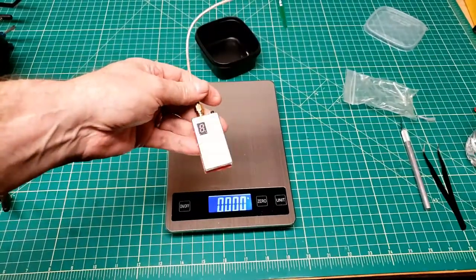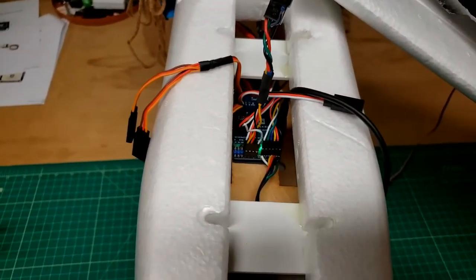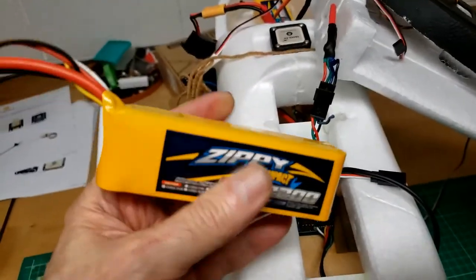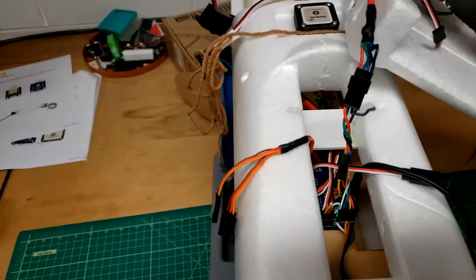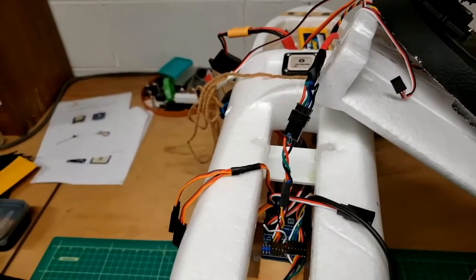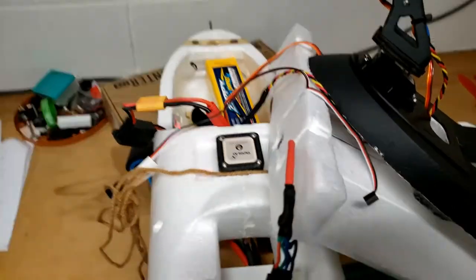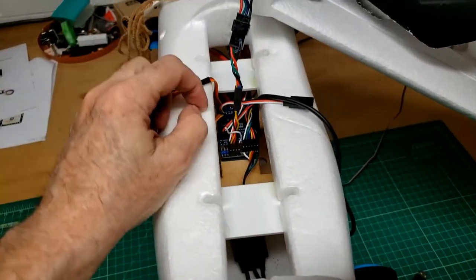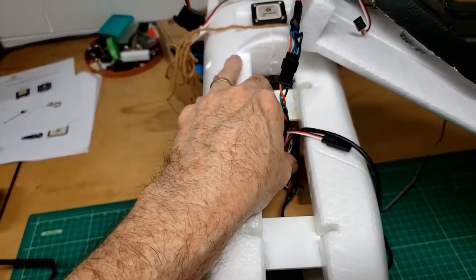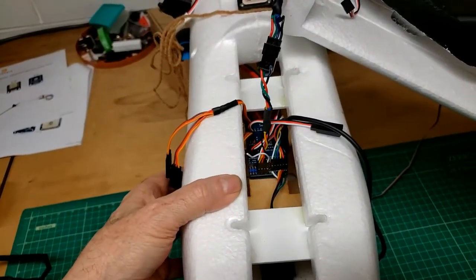With that, let's see if this damn thing will power up. Okay, we're powered back up. I thought I had figured it out for a second. I was using a 3S just to power it, and that was 11.2 volts when we saw it on the Mission Planner in the first video tonight, I guess it was. So I switched over to a 4S where I had more than 12 volts. Not that I know that the voltage regulator inside this flight controller could develop 12 volts from an 11 volt supply. I have no idea if it can or not. Asking it to is probably not great.